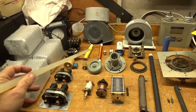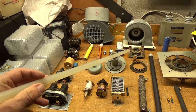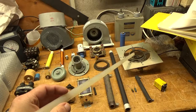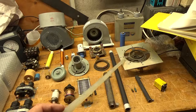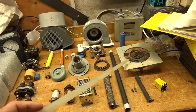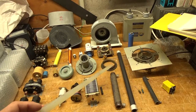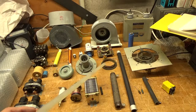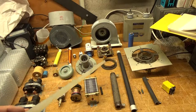Moving on to sockets. I see a lot of amplifiers — like a 3CX3000 or a 3CX6000 — where they just ground the grid of the tube by using washers instead of using a real socket. A new real socket is around $300. I prefer the proper socket over that approach. It's very important to have the grid securely grounded in a grounded grid amplifier, or even if you're running a tetrode grounding both grids, because if the grid were to lift above ground, you could end up with the full plate potential across the cathode of the tube.